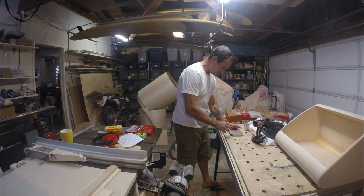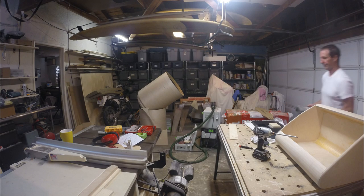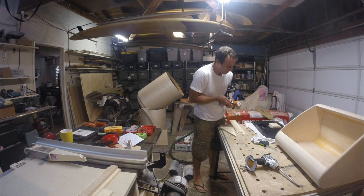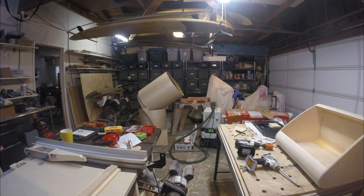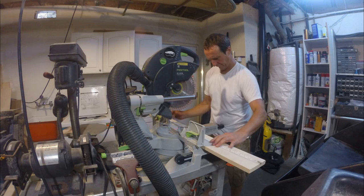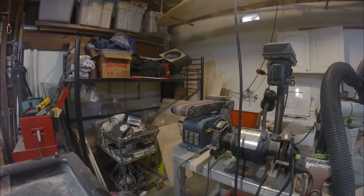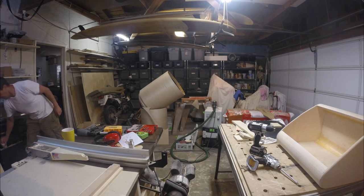I'm going to take that plate and mount it to a little square block of wood with tiny wood screws, then mount that block to a crossbar that goes all the way across, with a couple of flanges that drop down. I'm also taking some eighth-inch thick plywood with a hole saw and making wooden washers that will be the pivot points, so the whole side of the cross brace doesn't rub. It minimizes enough friction to keep locking in place when you tighten the side screws, but not so much that it gets stuck.